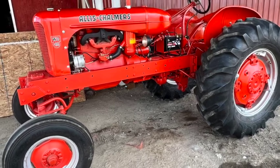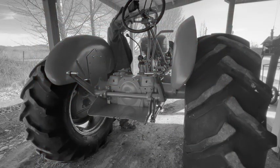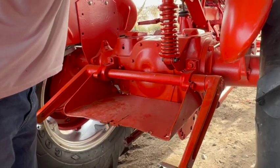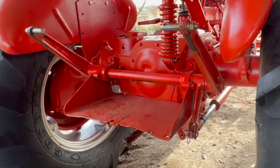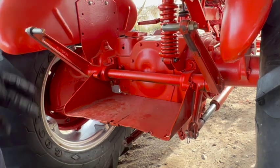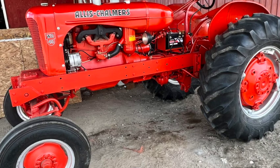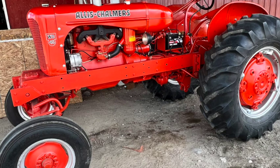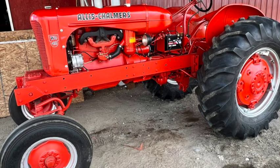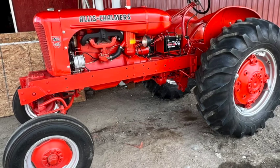If you remember from previous videos, the hydraulic system was not working at all. Well, I finally got that figured out. Well, that's the good news, but making a long story short, the hydraulic fluid is leaking inside the tractor, internally, down into the transmission differential fluid chamber. In other words, the hydraulic system won't hold fluid, which is causing the rear lift rams not to work.